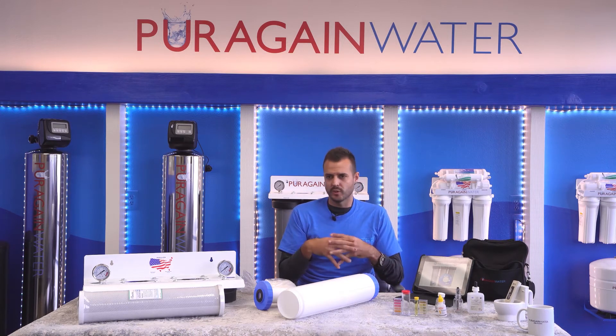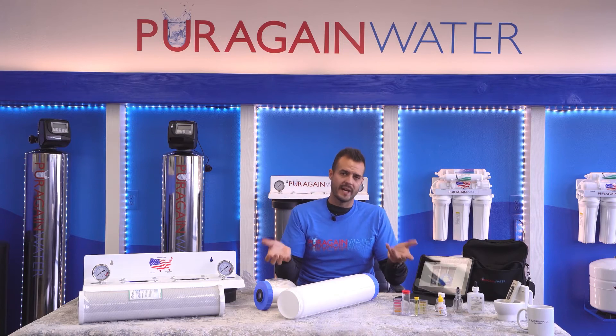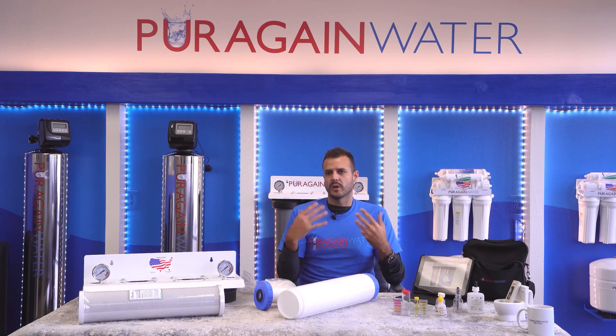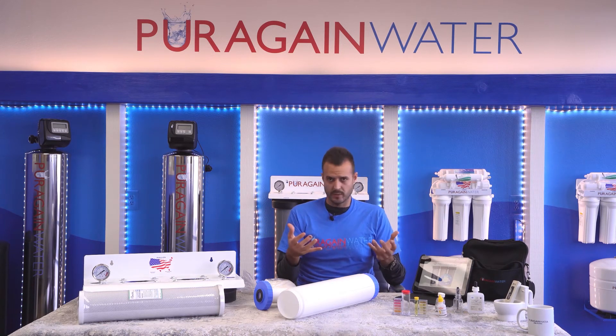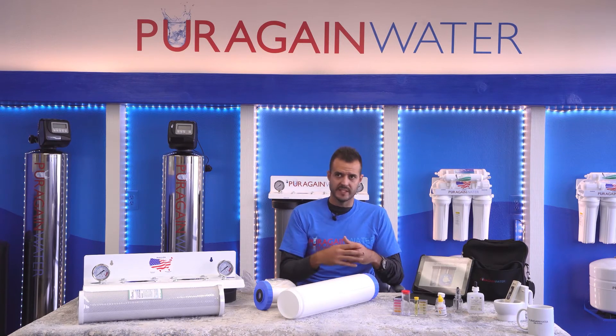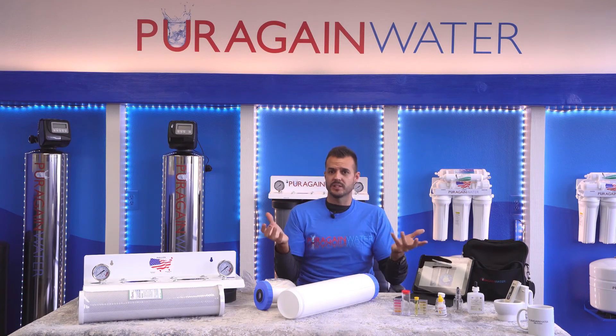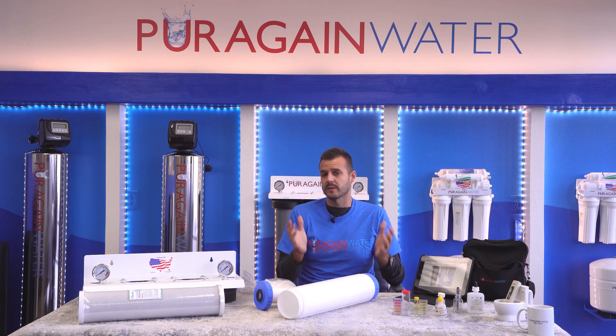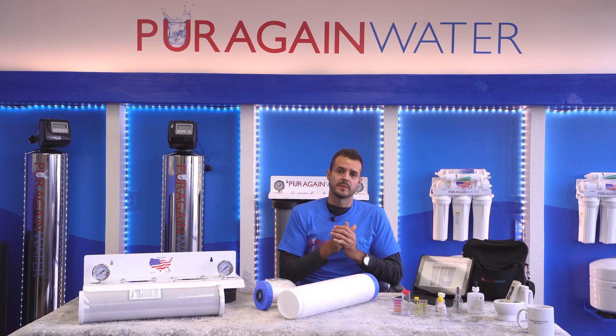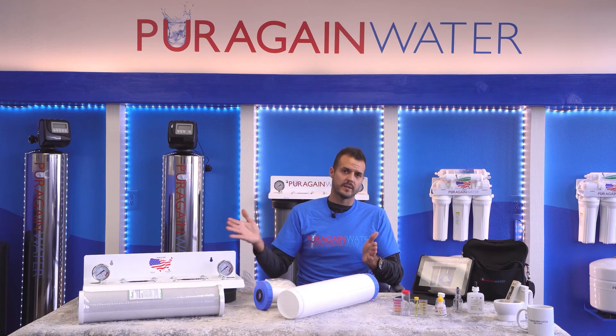If the house is brand new and there's no buildup in your pipes, typically the results are right away — there's no dissolving of any previous calcium-magnesium, so the system works at peak performance from the start. We do a lot of installations at homes that are 30 years old, which could have 30 years of buildup. I always tell those customers to be patient, because it's going to take anywhere from three to six months to do the full dissolving and neutralizing of that calcium-magnesium mineral. In a sense, we do the install and the system just gets better and better as you use it.